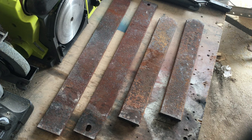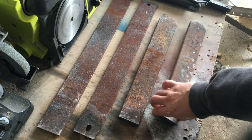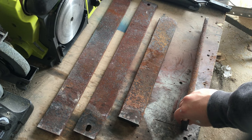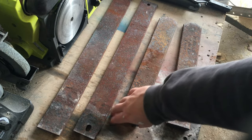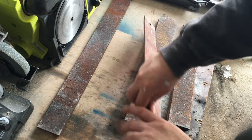All right, so to not ever have to go through that again, I've made myself a little brick forge. It's not a forge, it's more of just a little heating oven using fire brick, and that way I can heat the metal using just blow torches or whatever, and also heat treat the steel when I've done my final products. So anyways, in the meantime, these worked out pretty good actually. I don't know if they're flawlessly flat, but they're lying flat on the table. They're pretty good.